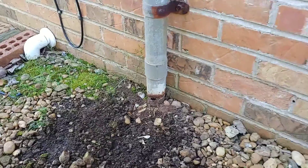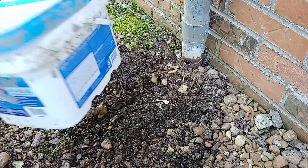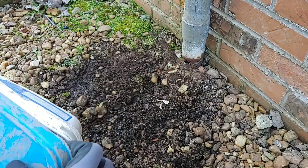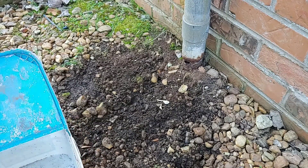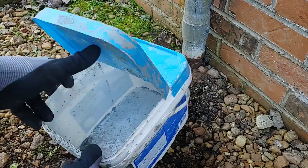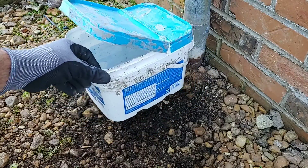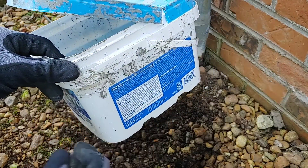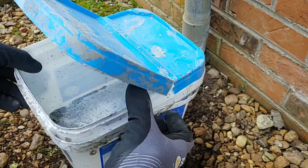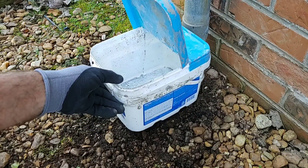Real inexpensive. So you're going to want to get a small bucket. I've got this Clorox pool bucket here — it's just an empty bucket I was going to throw away, but I'm actually going to cut this thing apart. I'm going to cut the bottom of it out and cut the back so I can get it positioned in here. I'm going to dig the dirt down around it and use this bucket as a form. After the concrete cures, I'm going to pull this bucket apart and it's just going to be a nice shaped poured concrete little slab.